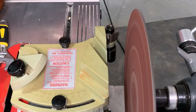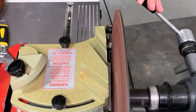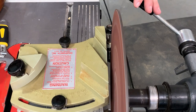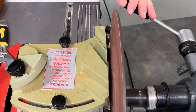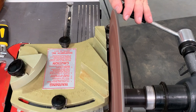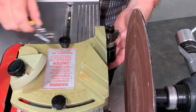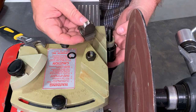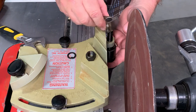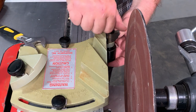I'd love to stand on that side of the headstock but I really can't to see what's going on. We're just going to kiss this very gently against that cutter. Unless I'm trying to remove a nick, all I'm trying to do is sharpen, so we're not removing much metal at all. And we've got a nice clean face on that — not that it was bad to begin with. That's essentially how we can grind our cutters.